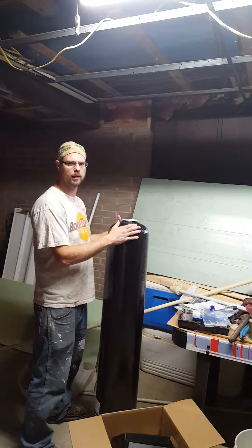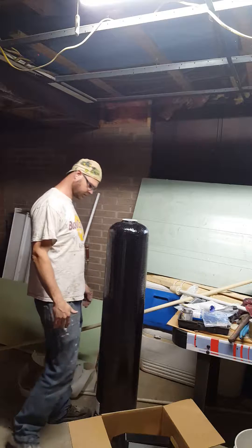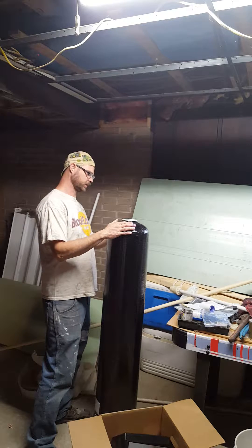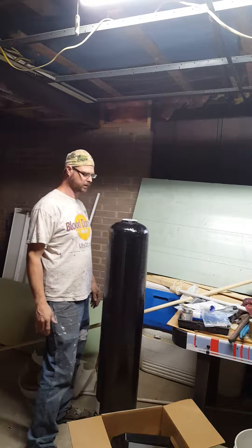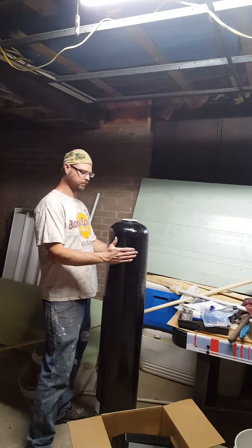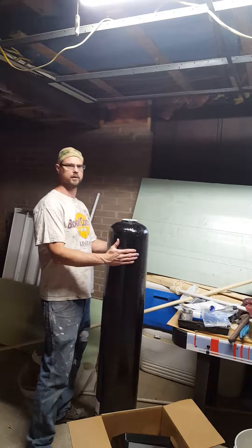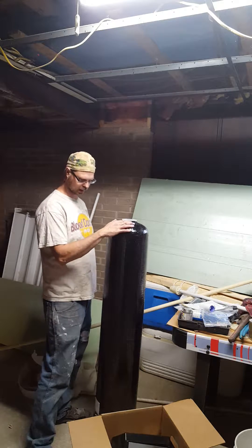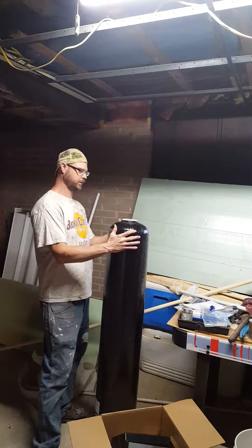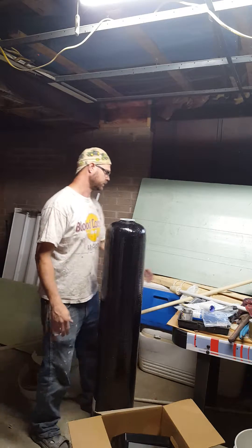I'm doing a video on a DIY on how to build your own water system. I'm not a plumber, I am an electrician, but I built my last system and have a video of that. I'm building another system because the last one didn't work exactly like I wanted — I should have used some type of backwash media. I'm using Catalox Light because I have high sulfur and iron in my water. This system I bought from Aqua Pure Water Systems has an air injection system.